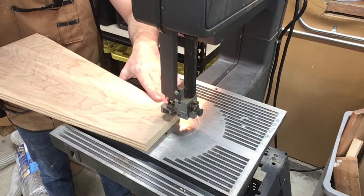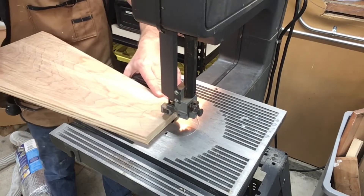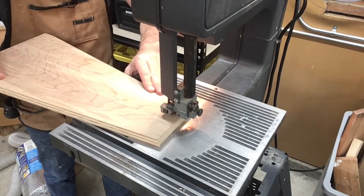We'll take our side to the top. After we've cut out the main piece, we're going to take it over to the bandsaw. It's important to make these relief cuts first before you make the tight radius cut, so that each piece can pop out and the blade won't get bound up.